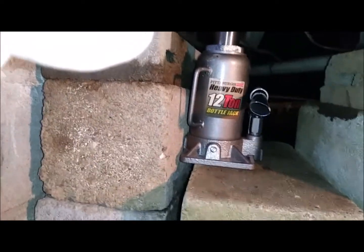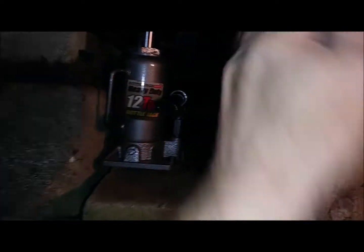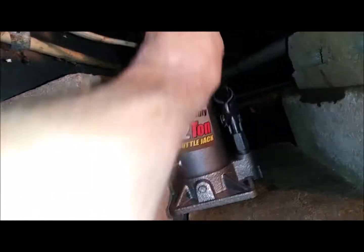Friends, Tommy Easy Choice — a little segment here. I've got this little bottle jack, it's 12-ton, and it's working beautifully. We actually have two parts of the floor falling — we've got the front here following this girder going one way, and this girder going the other way. When you're dealing with that, you have to work simultaneously. You can see the floor going up.